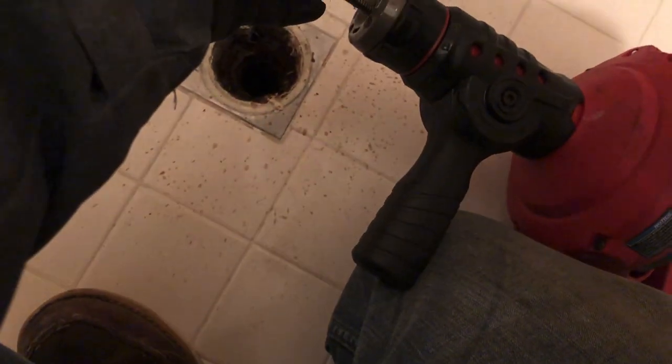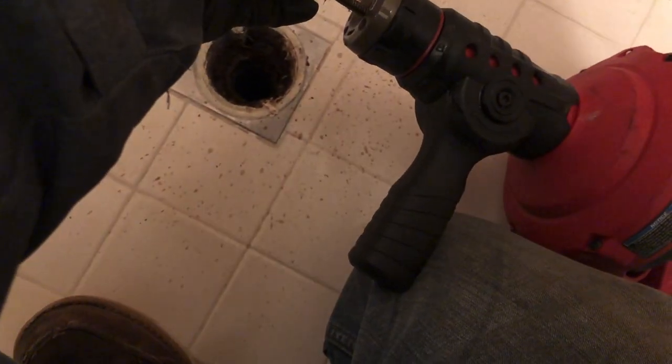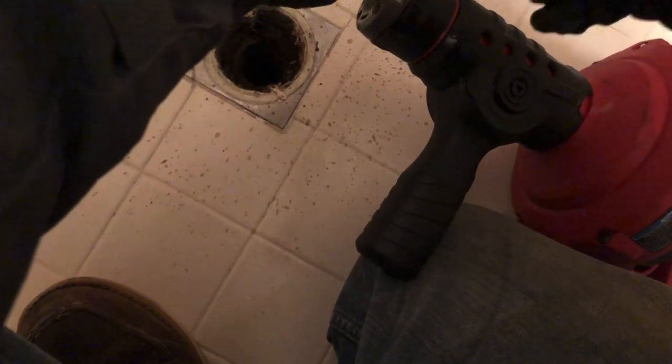These cables are only 25 feet long, so like I said it's usually within the first 10 to 15 feet. I popped it here pretty quickly. What I always recommend doing after cleaning a clog is running hot water — run it for a while. And if you want, you can even snake it again while running that hot water, and that will help break up a lot of the soap scum and stuff that's stuck inside the pipe that's catching hair and causing the clogs.